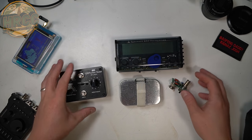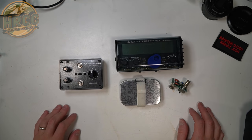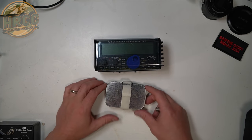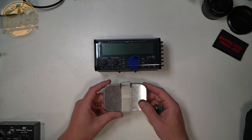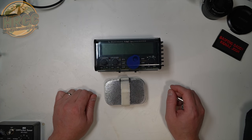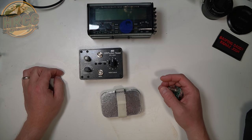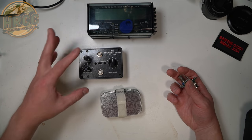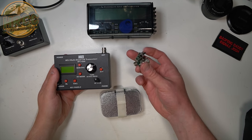Here's kind of what you'd use. I use this in the field if I want to make an antenna out of something unexpected. It's really the magic of this box that allows me to play around with the internal tuner of the KX2. If I wasn't using something with an internal tuner, I use this MFJ QRP pocket tuner, which has worked really well. I've used this for 9-to-1 un-uns, some exotic materials. I also like to use this QRP Guy's tuning indicator.